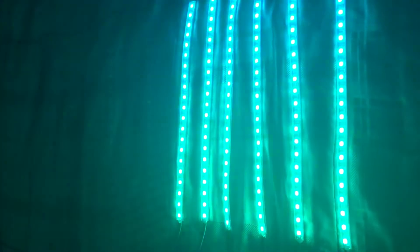This is my light harness in the dark. It has all different patterns. These are 12 volts, which means they can only do the addressable, but they can only address three LEDs at a time — because at 12 volts the LEDs can't handle more than four volts per LED, otherwise it would burn them out. So they got them paired in threes, so it goes one, two, three for a whole set.